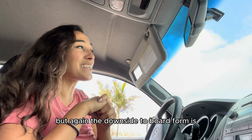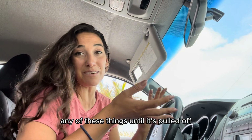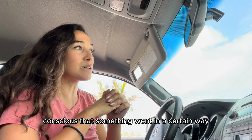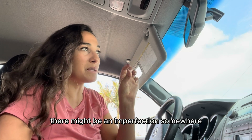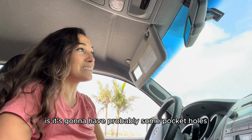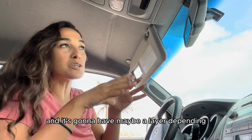But again, the downside to board form is you don't get to see any of these things until it's pulled off. So unless you're very conscious that something went in a certain way, oftentimes you're not going to know that there might be an imperfection somewhere. And so that is the charm of board form, is it's going to have probably some pocket holes and it's going to have maybe a layer or two depending.